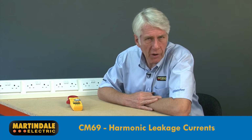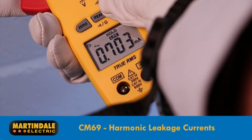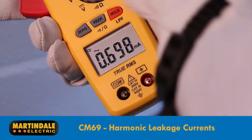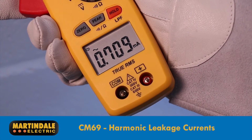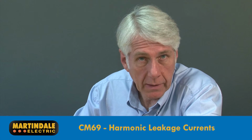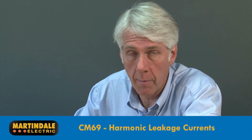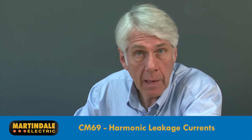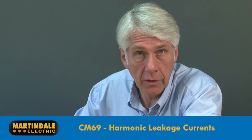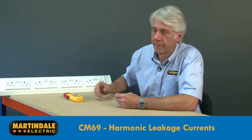To reliably measure and troubleshoot harmonic leakage currents, it's essential to use a true RMS leakage clamp and turn off the 50 Hz low-pass filter so the higher frequencies can be included. Most leakage clamp meters have low-pass filters permanently set at 50 Hz and are not true RMS. This makes them unable to see the higher frequency components or reliably measure distorted waveforms caused by the harmonics.